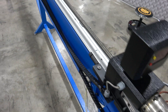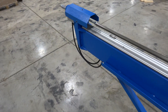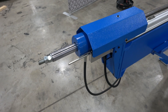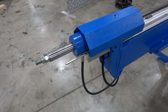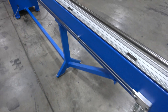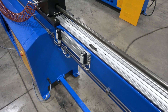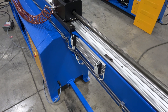We're going to move back here a little bit — you can see the table extends back. On the back of the table, you've got your cylinder for moving your mandrel rod in and out, and your adjustment on those nuts for the distance of position on the mandrel itself. A couple lines feeding that. This machine has a very simple hydraulic system, about a 5-gallon reservoir. The hydraulics are for that cylinder on the back for the mandrel rod, and also for the clamping pressure we'll talk about in a minute.